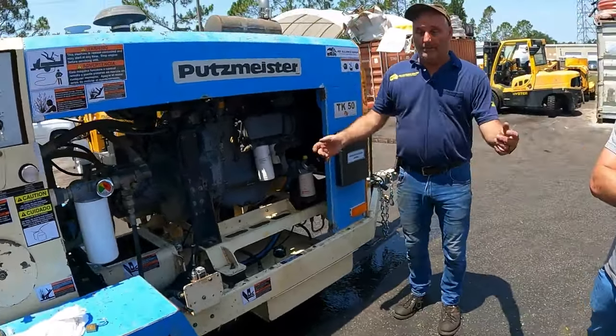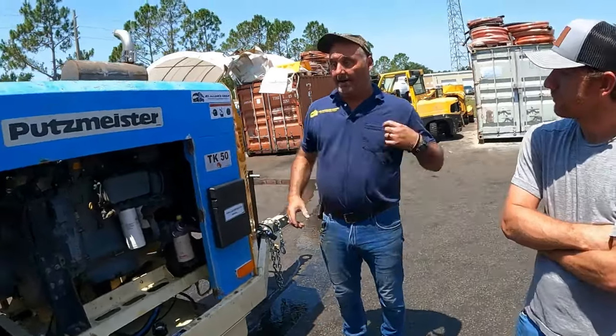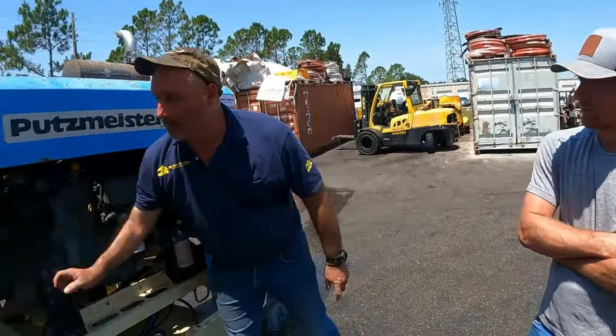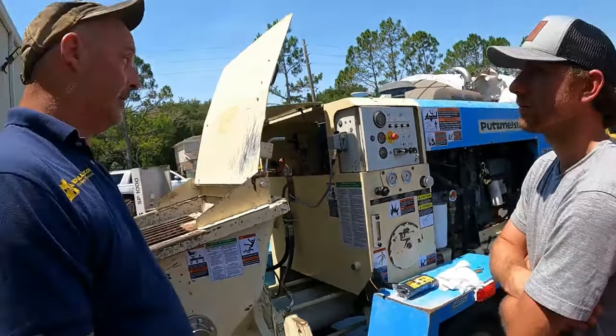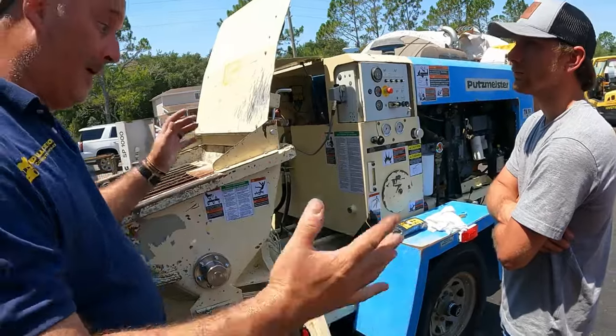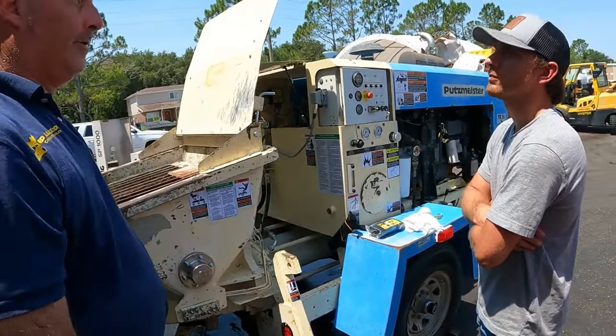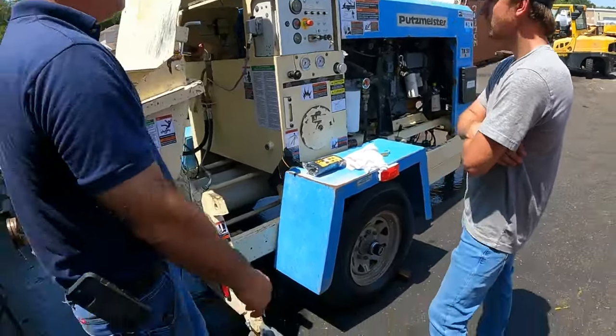The accumulator system is a cheap way of making an extreme amount of power. On an accumulator, you've got a small pump running an air bottle. This bottle has a rubber bag in it, and we put inert gas, nitrogen, in it, so it doesn't blow up and kill you. That bag has 100 bar, plus 100 bar from the pump against it, now you've doubled it, 200 bar. And that's what you see here on the switchover for the accumulator. So you're gonna see it bleed down.